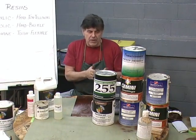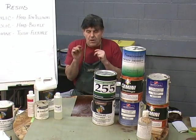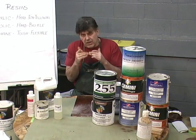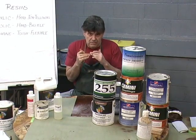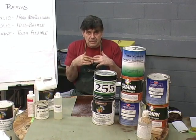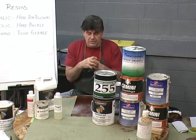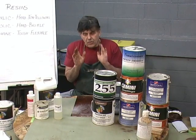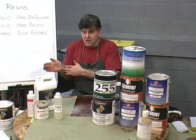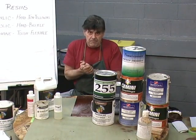Crosslinkers added to water base, we talked about them molecules gluing. What the crosslinkers do is, it's kind of like the difference between being glued together and being welded together. It creates a much stronger, tighter bond, and again, helps to reinforce the film molecules. Cross-linked finishes, post-catalyzed finishes are the toughest, bar none. Okay?